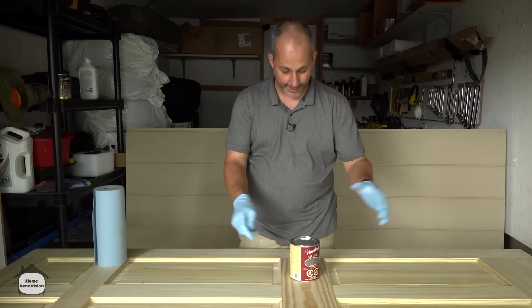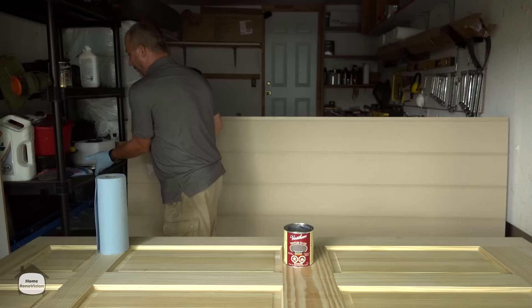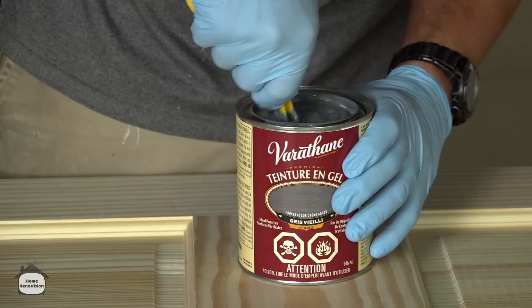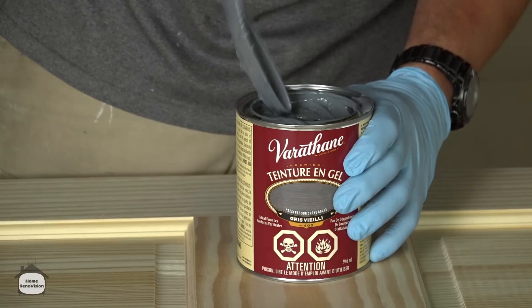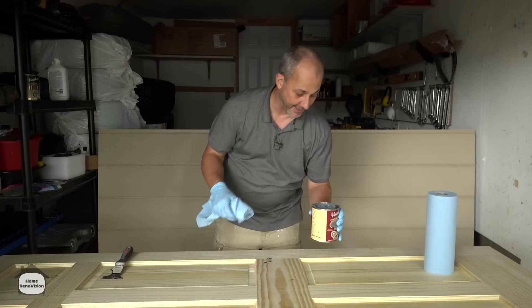Take your paint tool to open the can. Remember, oil-based products don't get shaken — they get stirred. Do not shake your oil. One of the best things about gel stain is it hardly needs stirring at all. With gel stain, there's not a lot of action when you stir it — no color changing, nothing going on. It's almost redundant. Traditional liquid stains are totally different — if you don't stir them, you don't even have a stain, because parts of the pigment will be separated.